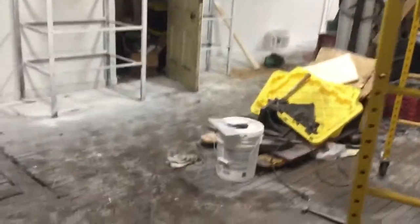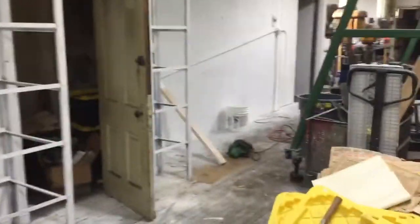This is the spot in the floor that's water damaged from the leak we're fixing. What I did yesterday is I took the circular saw and cut the space between the boards to let it settle a bit. Overnight it settled about three-eighths of an inch because it was pretty dry - water hasn't been dripping there for some time. I was just curious if that would actually work, and it seems like it is.